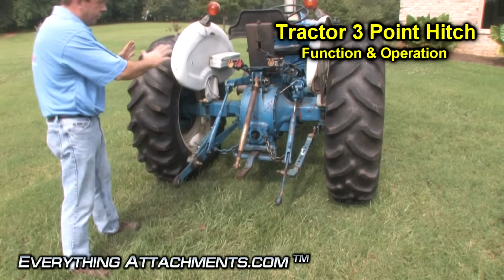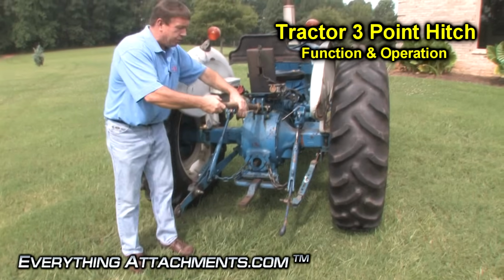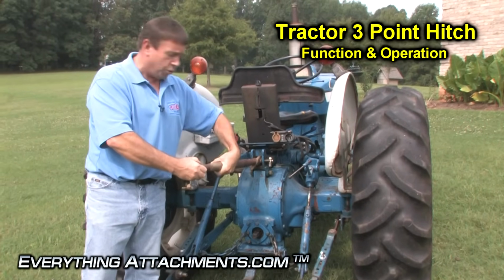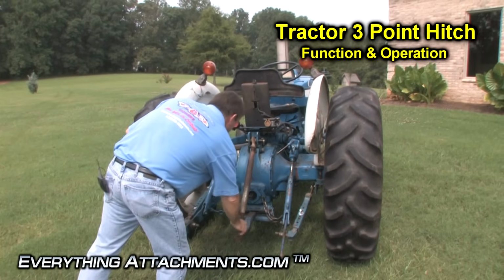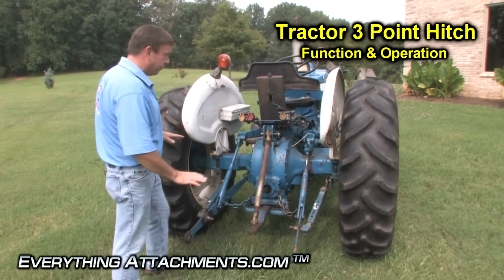Okay, so we're going to just go over the general components here. This is going to be your top link, and this is what's going to adjust the pitch of your implement, whether you make this longer or shorter. So that's an important item, and that's useful in every tool you use.